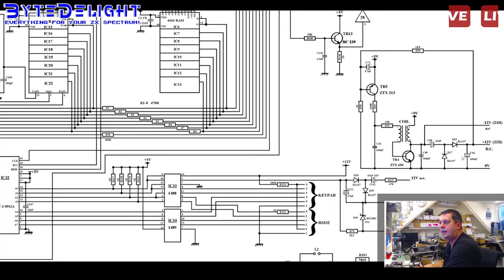And at the end, I thought, well, let's check all the capacitors. Let's start with 100 microfarads here. That was okay. That came exactly to 100 microfarads. I checked the small 560 picofarad one, which is important for the oscillating for TF4, but it's okay as well. And what I forget all the time was C80, the 22 microfarad, but I couldn't believe that could be a cause, and I will show you what happens.